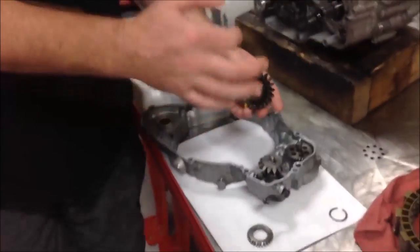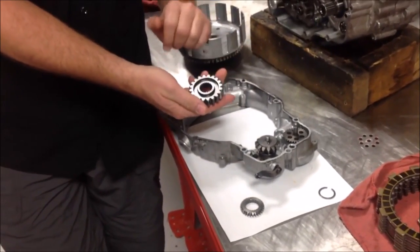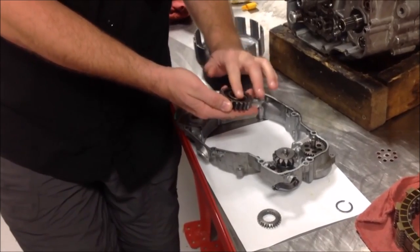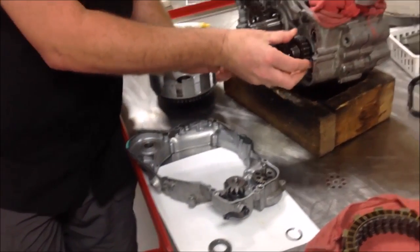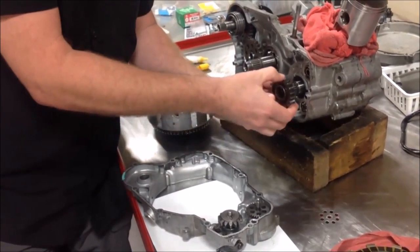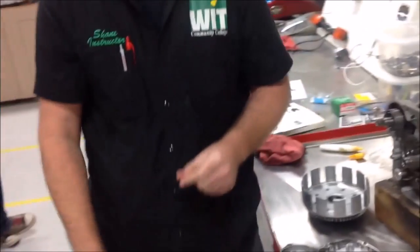Every mechanic should know witness marks. Another term we talked about was chamfers — flat machined edges — and we talked about bosses and shoulders, where this is going to shoulder up against that. If we put that chain on the other way, would it have as much contact? No. Keep working on your skills.